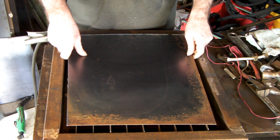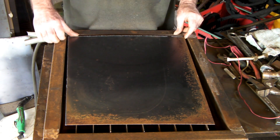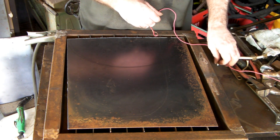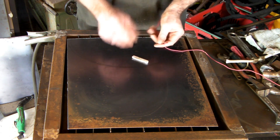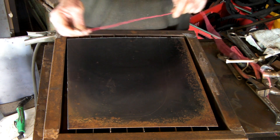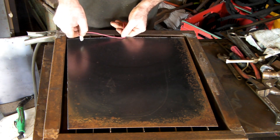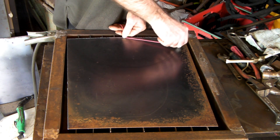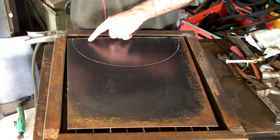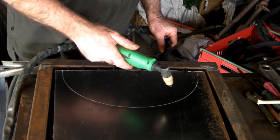What I normally do — what I started doing anyway — was grab a bit of old engineer's chalk and an old piece of wire, put the chalk in the wire to give me some sort of guide, measure it out roughly to about halfway, and then draw my half circle. Then cut it out freehand. We'll cut that out freehand and see what it looks like — I don't know if your freehand cutting is any better than mine, but mine really sucks.